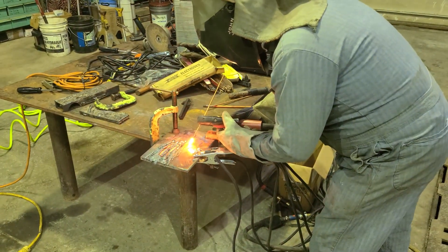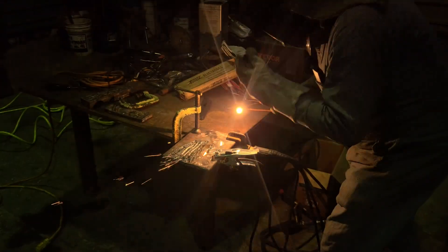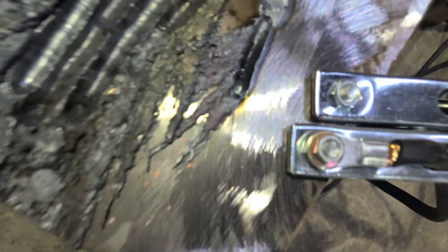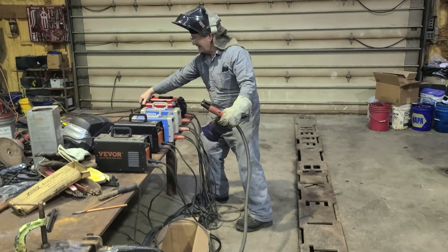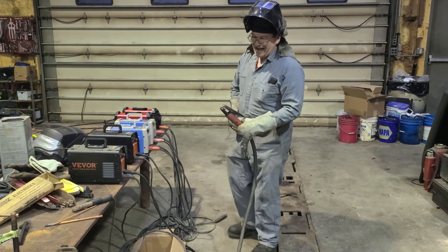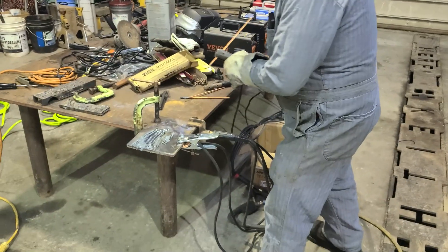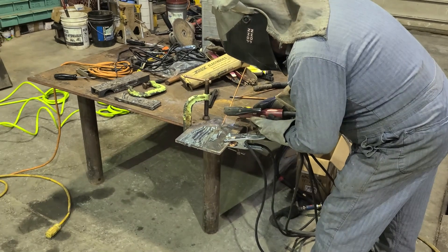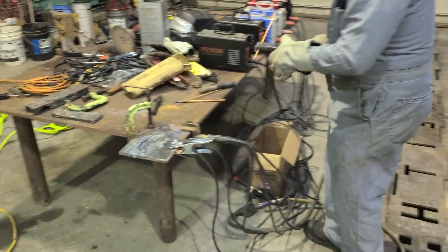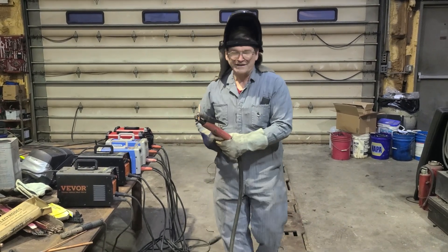Air on. So you can do it on that. Let's try one welder — now we're down to one. We'll try it with just one at 80 amps, where it would draw 20 amps. I don't have a lot of hope, but we'll try it. Let's imagine we ran some 10-gauge wire and put a 30-amp breaker in it, and see what one of these will do by itself.